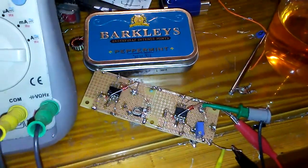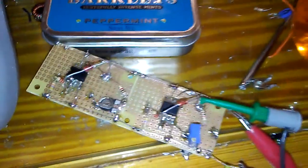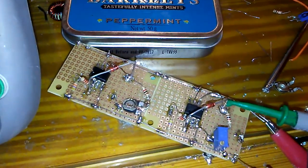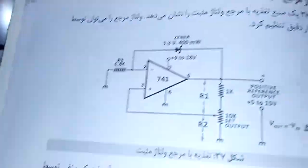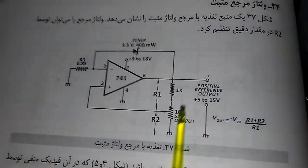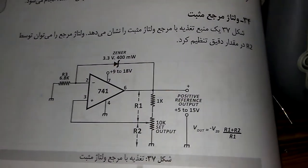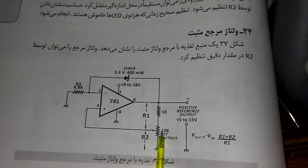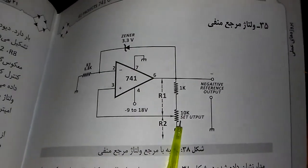Hello guys, hope you're doing well. Today I try to make an op-amp UA 741 reference voltage. It is working pretty well. Here is the schematic with positive output — op-amp UA 741 adjustable voltage reference — and the other schematic I'm going to show is the negative one. This is a negative voltage reference, it is adjustable. You can see that I have a 10k pot here.